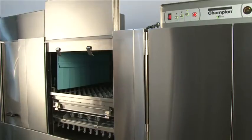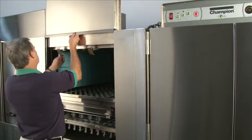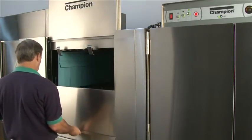Once cleaning has been finished and everything is back where it should be inside the unit, to close the doors, first start with the door closest to you. Push back the bottommost hinge and slide all the way down. You'll have to move 2 sets of hinges in order to let it set in place.